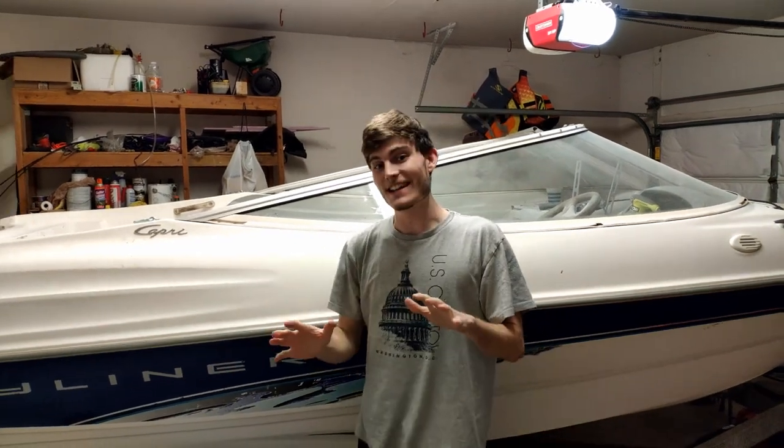This is where we are going to end today's video. As you saw, when we put that fiberglass down on the deck, it was completely white. But then when you coat it in that resin, it turns the fiberglass completely transparent. And you could see through as if you're looking just at the wood. And that's exactly what you want. And that's how you know you did a good job putting the resin onto the fiberglass. It turned out really good.